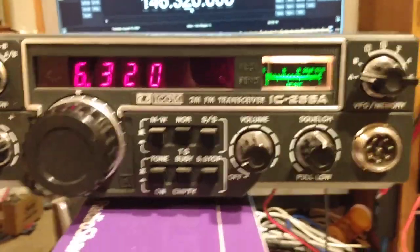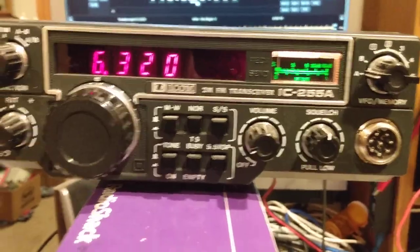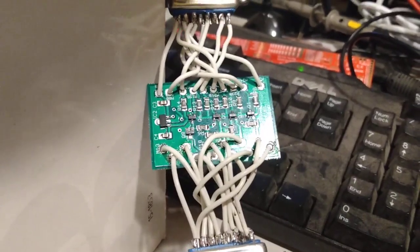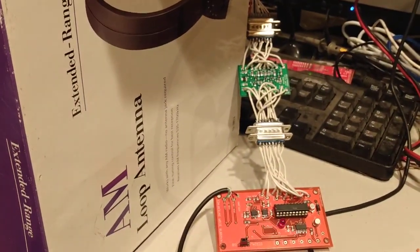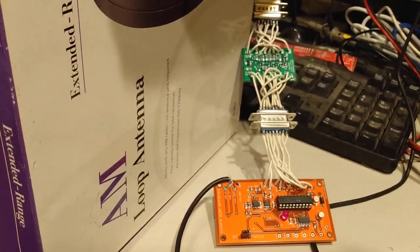This is also the first radio that's going to use my new interface. It's electrically identical to the old daughter board that some radios need because they have 9-volt processors instead of 5-volt. So there it is — that's the new board, and that's going to be available now. All that wiring is there not because you need it, but because I need it, because I do some testing where I have that board inside and outside, since other radios need 5 volts and don't need that converter.